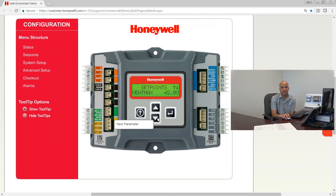If you have a CO2 sensor, you'll see vent max and vent min instead of the minimum position setting — it's one set of values or the other. Vent max is your code-required amount of outdoor air, typically 10%. Vent min is the square footage portion of the code-required amount, which would always be lower than vent max. Those are the settings available there.